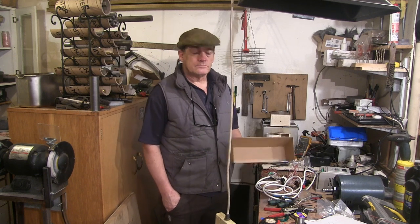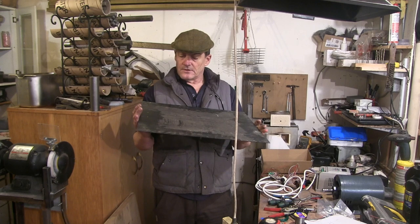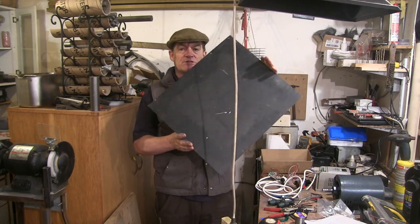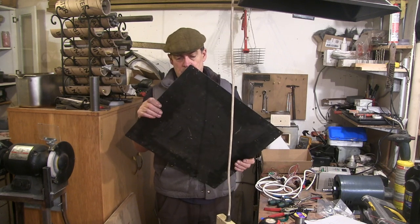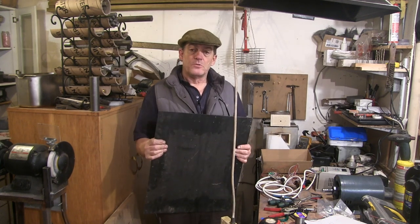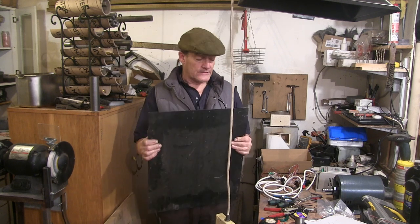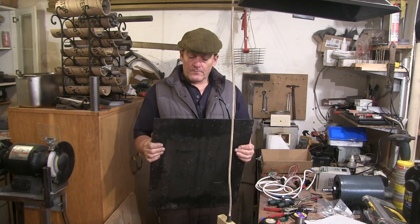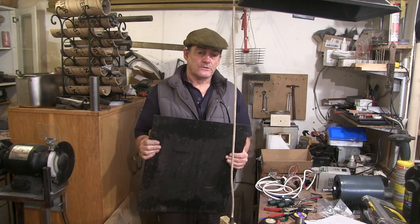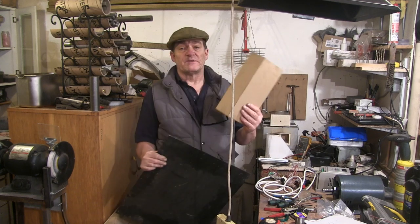That's where it's going to go, and I've got this old bit of aluminium I've had kicking about for ages. I don't think it's anodised - I think it's just been painted or coated. It's got an awful lot of holes in it. I've got some of these aluminium welding rods - I'm going to give them a go cutting this out and putting it together. I'd like to bend it into shape but I can't bend this neatly, and I figure it'd break anyway. So my next move is to put the little cutting table on the bandsaw, change the blade - I've got a coarse one on it at the moment - and start cutting out.